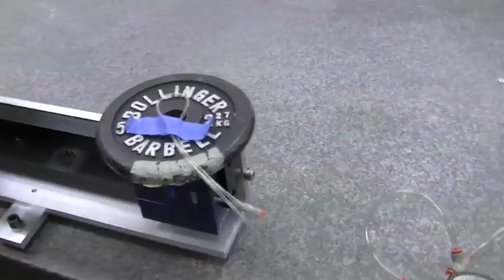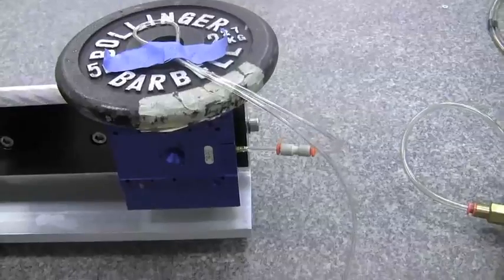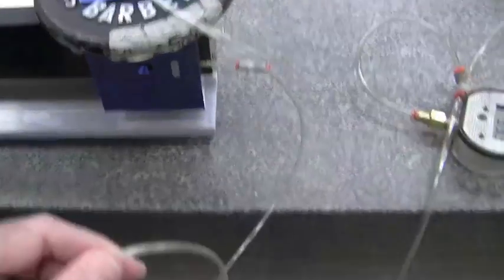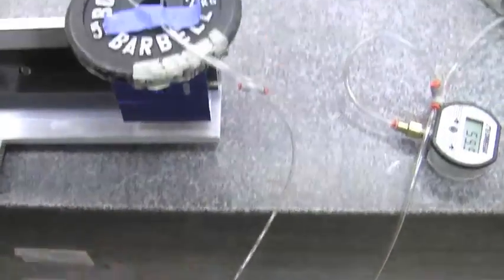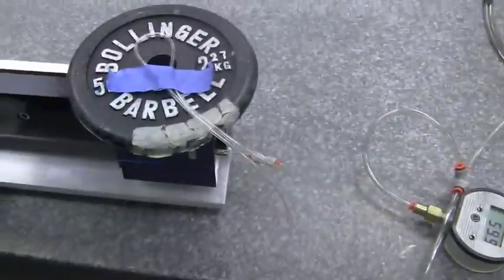Here we are at New Way. You can see the right side truck on the right side of the rail. This is where we had the little sticky issues. I'm holding the tube right here, trying not to put any influence on it. Now we've got 60 PSI being fed to the bearing.